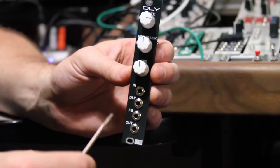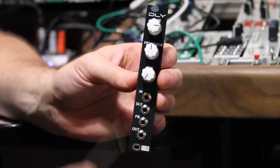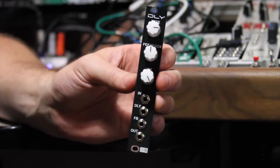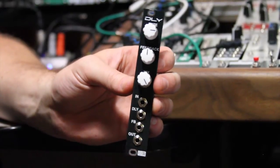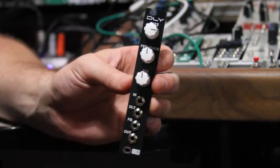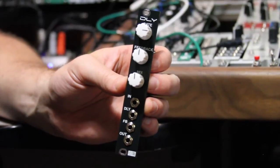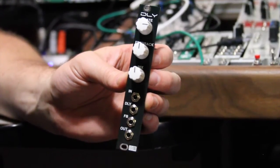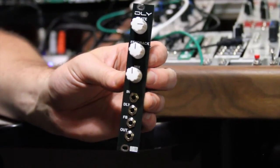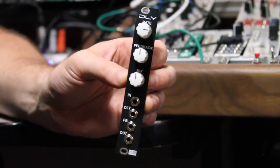As far as the way the mix circuit works on the delay, if you turn the mix control all the way counterclockwise, you have a full dry signal coming through, and if you turn it all the way clockwise, you have a fully wet signal. This allows you to find where you want your dry and wet signal mixed, and it allows for effects sends and other features like that. That also affects the way the module sounds and the way the feedback sounds. I want to bring you over to the module and see how the differences relate to the echo.